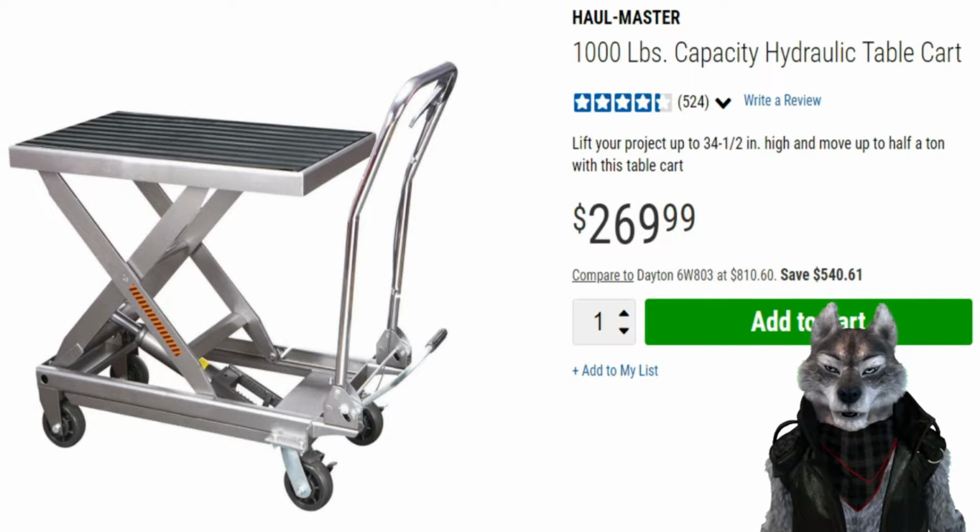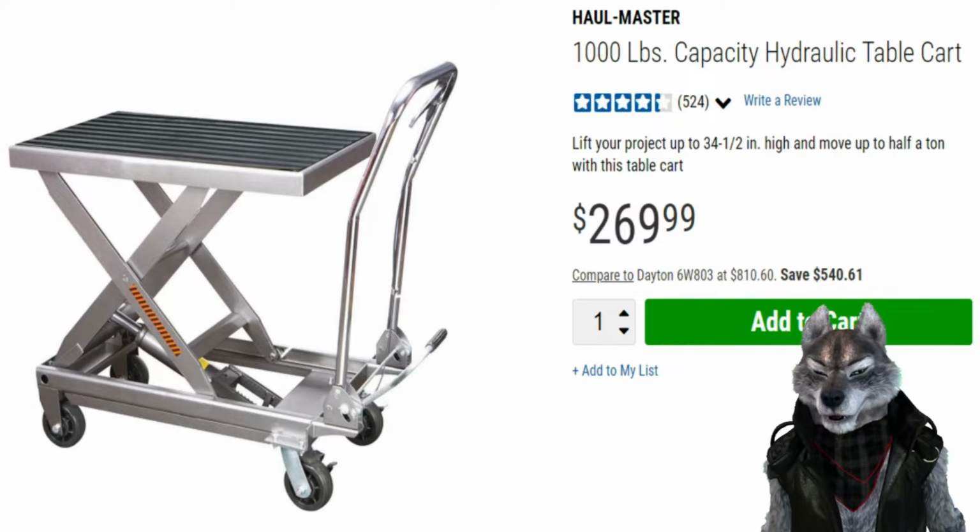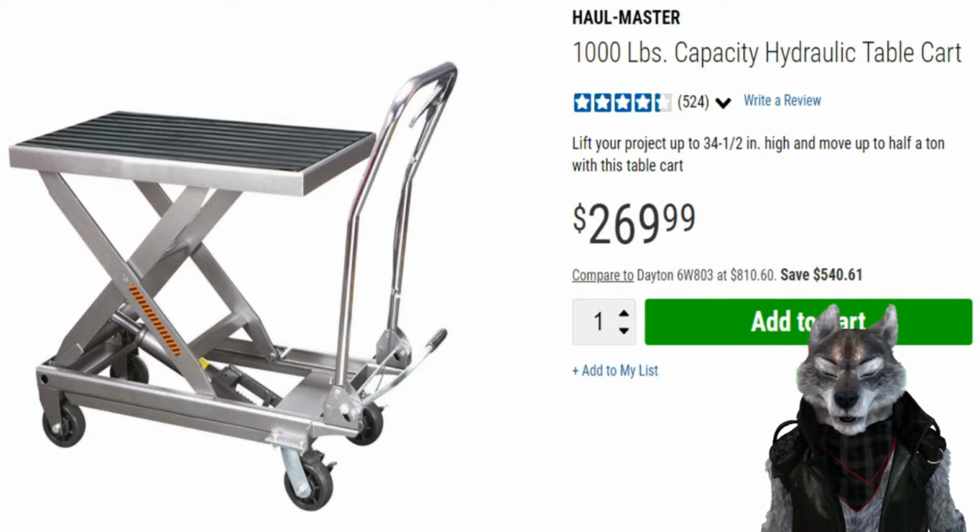The first one: there are two ways that little fill screw on there is manufactured. The first one actually has a threaded screw, but the seal on it is not all that great. Somebody wrote in one of the articles that it has some kind of plastic washer. So what they did is they got a 5/16 galvanized sealing washer. That's steel with a rubber molded washer on it, and they replaced it and it's worked fine. Should you have to do that? No. Should it have come complete? Yes. But this was a quick fix for this particular person that had bought this.